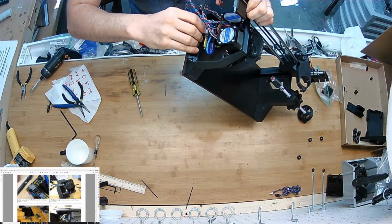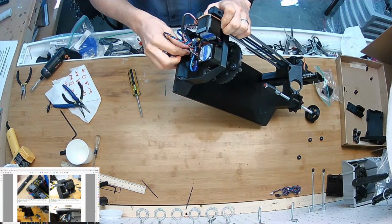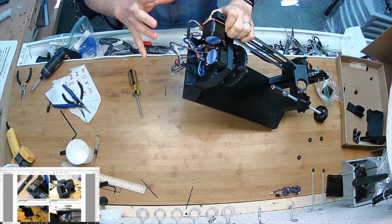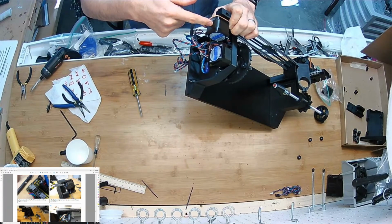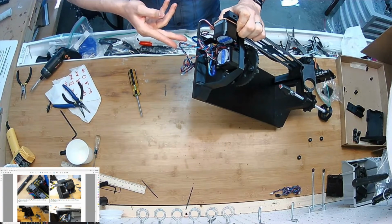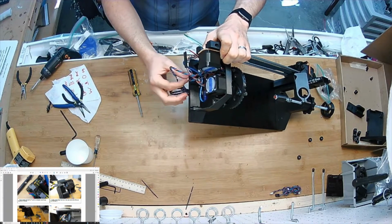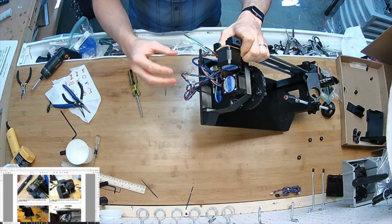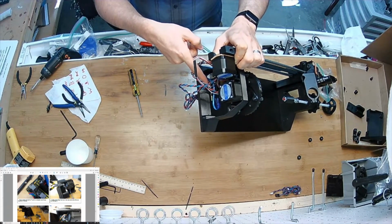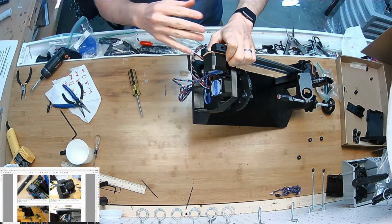And the consequence of doing this in reverse order would make the motor move in reverse from what you expect it to, and you would notice that during the calibration procedure we're going to do a little later. And if you plug it in backwards, let's say this is manufactured a little bit different because it's a different lot or something, and you discover that you need to flip the direction, unplug the power from everything. Take the power out before you pull this wire out. If you disengage this wire while the power is on, it's just intrinsic with this type of driver. You can burn something out. They have too many coils in them, and it can induce a back EMF and just nail it.